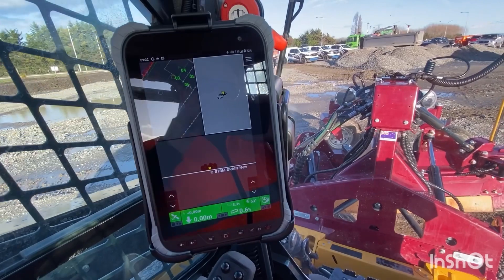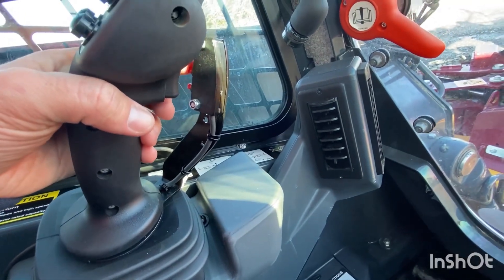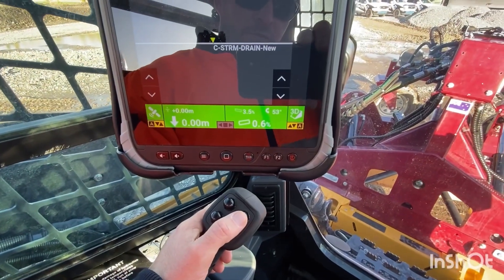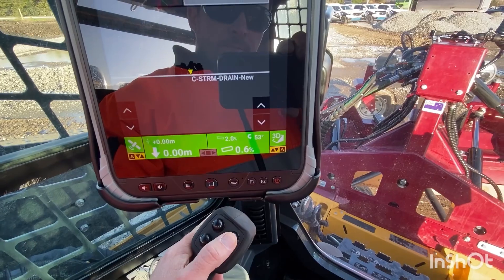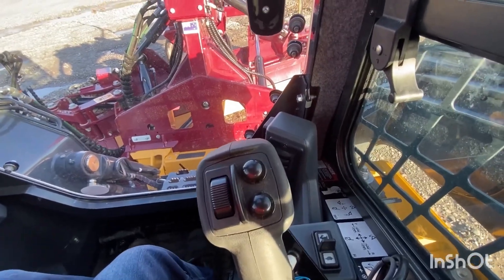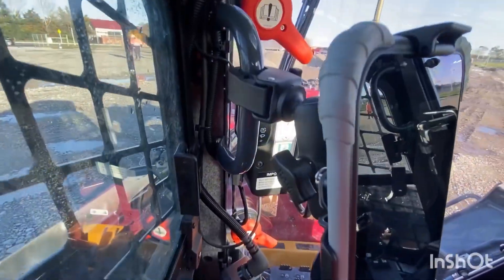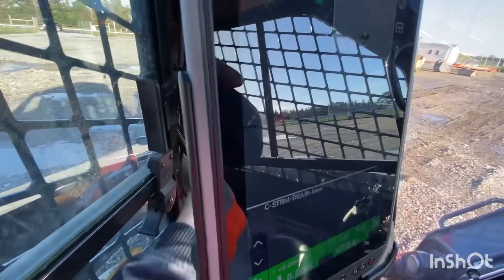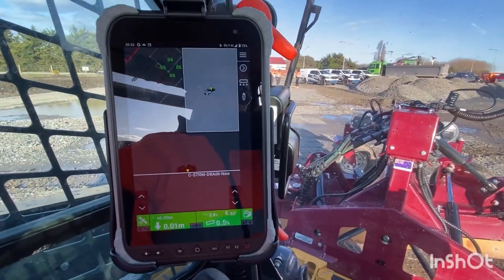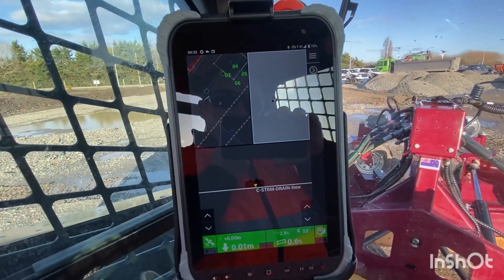Inside the machine, the joysticks have additional controls for your wings and rotate. Automatic is engaged by double pressing the lift on the left raise ramp, so you're engaging in and out of auto. This is repeated on the other side for rotating the other way and adjusting the other wing. The tablet is again all wireless, so you can position it wherever you like — a previous GX55 cable was used for the older generation screen but isn't actually required in this setup.